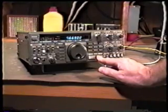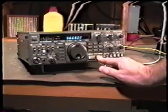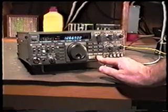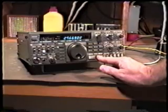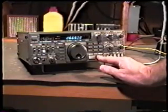If we had a blank digital display on certain bands, that would indicate another problem dealing with PLL unlock. And this is not associated with that. This is only associated with low receiver sensitivity on certain bands. And the cure for the problem is only going to take care of that problem and no others. So we've held this down for approximately 2 minutes.